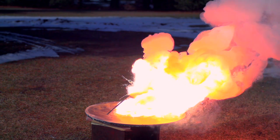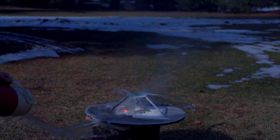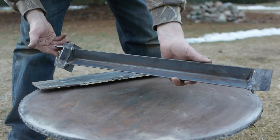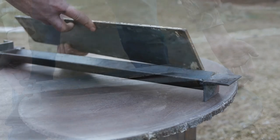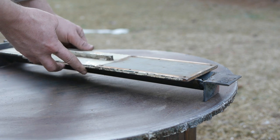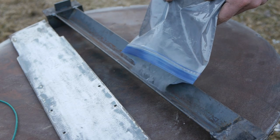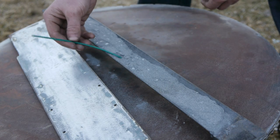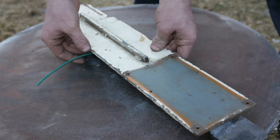Since I was already set up, I decided I may as well try this a few more times. Now that I have some evidence that potassium metal is condensing on my steel plate, I decided to change the setup a little bit. Here I have a length of angle iron that I've welded into a rough stand. I'd like to see what happens if I react my potassium hydroxide and magnesium powder in this channel with a piece of plate steel above. I'm hoping to see potassium metal condense onto this plate, and maybe with less exposure to air, some of it will be salvageable. I think I'm using a bit too much, but we'll see what happens anyway.